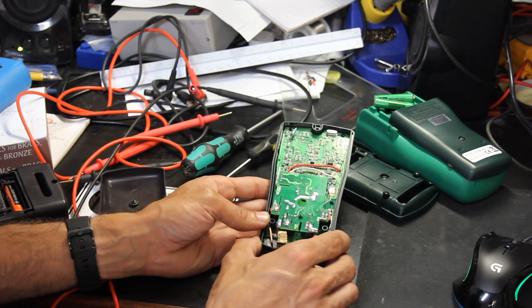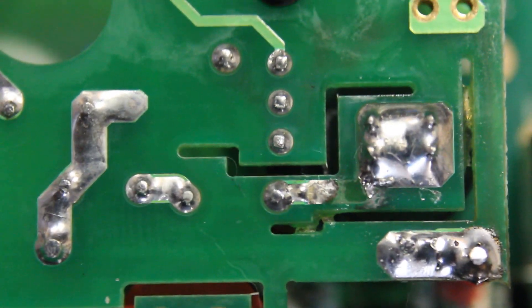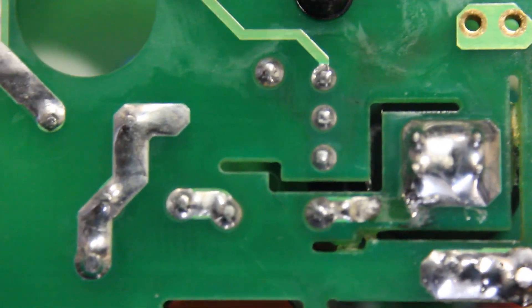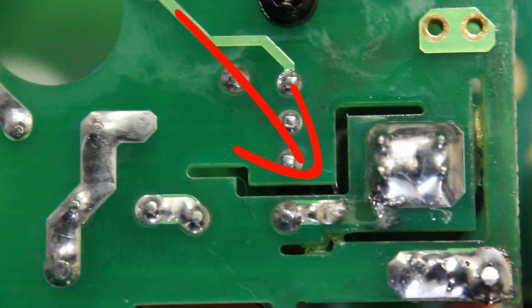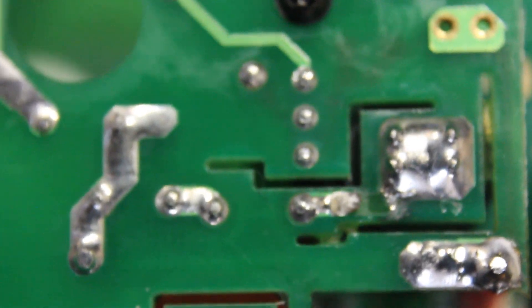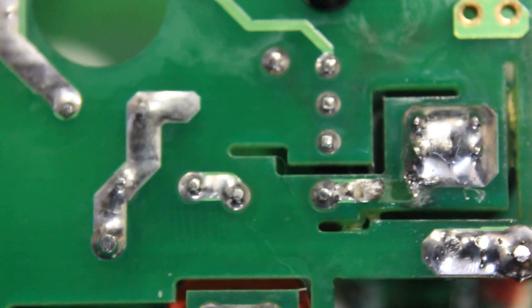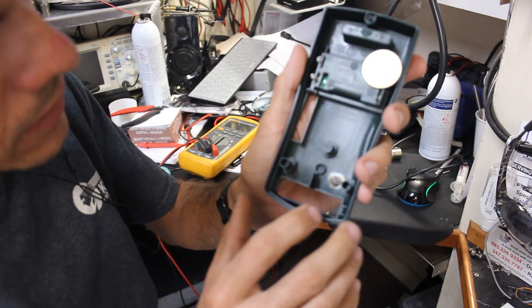I think I may have spotted the problem. I'm going to zoom in so you can see what I'm seeing. I've got the macro on the camera — apologies if it's a bit shaky. You can see right there there's a large solder pad, then the isolation slot, and a little to the left of that you can see just a small section of solder where there's supposed to be a trace and there's clearly not one. That may be the entire issue. I also noticed on the back of the meter there's a pretty good burnt spot right here.